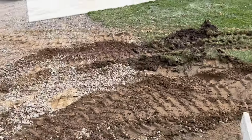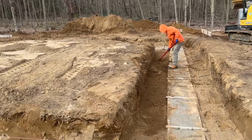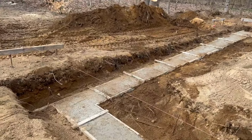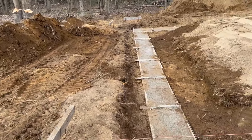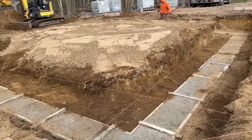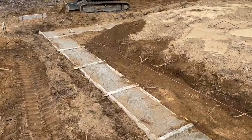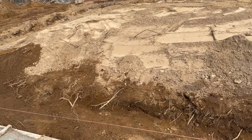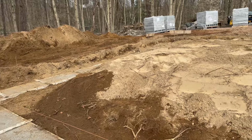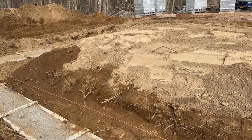Okay, guys. I just got back with our last load of blocks and the mortar. Chris has got this looking really good with the Yanmar and the Kevin the Kubota there. Got a bunch of it backfilled. It's supposed to get down to about 32 tonight, temperature wise. So we're gonna leave the footer forms on there, and we got it backfilled with the sandy dirt, so that'll keep that footer from wanting to freeze or anything. And we poured it at 8 o'clock this morning, so it's about 4 o'clock right now. So we're in pretty good shape. I like it. So tomorrow we'll be laying blocks. So I will be here tomorrow. Hopefully we can get a lot of this done. Maybe it all done. Then we can backfill and pour our floor.